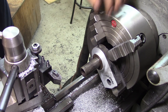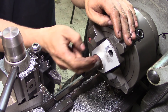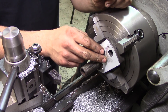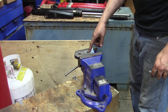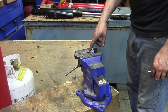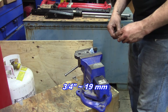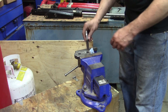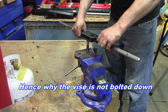We have a chamfer on that shoulder now. This little hole here used to have a bolt with the head right here, shaft going through on the other side of the frame. I don't want to lose any more meat than absolutely possible here, so we're going to use a little different strategy. The hole is actually just the perfect size to thread to a three-quarter coarse, so that's what we'll do. When we tighten it up we'll use some blue Loctite.